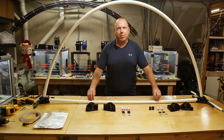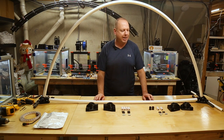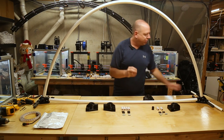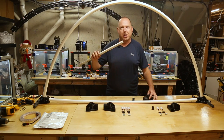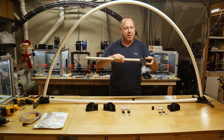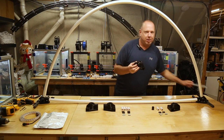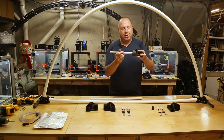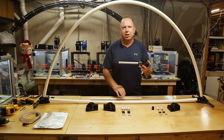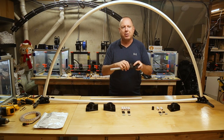On the standard arch, instead of PEX tubing, you can use either half-inch PVC or half-inch EMT. These standard bases come with a bushing that allows you to change the size of the opening. Right now it's designed for half-inch PVC, but by installing this bushing, you can use EMT, and it fits securely and can get screwed in place to make up your horizontal bracing. So regardless of your preference, you can use the same base for both versions.